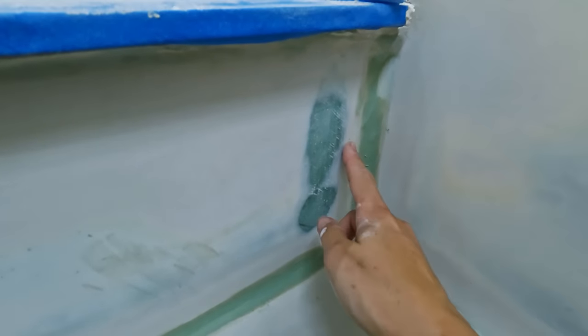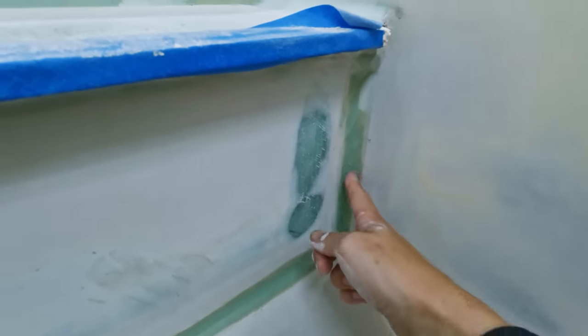So these should just need a really light sand. Just doing the last little bits to kind of fill these parts that will blend it into the other portions, but when I get that part done, I'm going to mix up some of our Total Boat fairing compound and then just take a roller and go over these coves so I can actually see if it looks like I'm doing it right after going over it multiple times from multiple angles. So that way I can move off of this project and then we can fair all of these surfaces one more time.